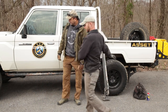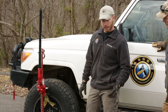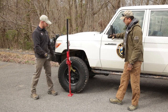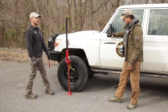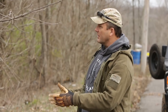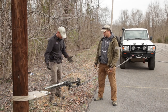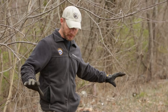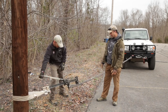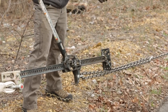That was the simple lifting operation — a scenario for changing a flat tire. Another scenario is when the vehicle is stuck and a tire has sunk into mud; you can use the jack with accessories to lift the tire up and put material underneath to get it back on hard terrain. There's also a hand winching application: if you don't have a winch on your vehicle you can use this jack as a winch. It's a four-foot shaft so you can pull four feet at a time to get your vehicle unstuck, then reset and repeat — that process is covered in detail in another video.